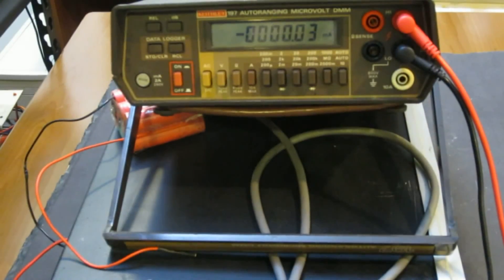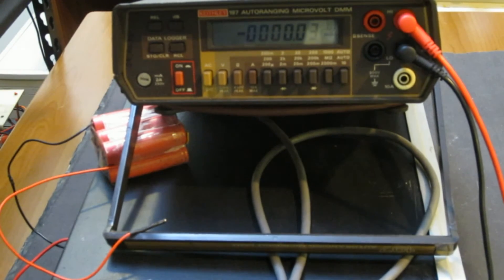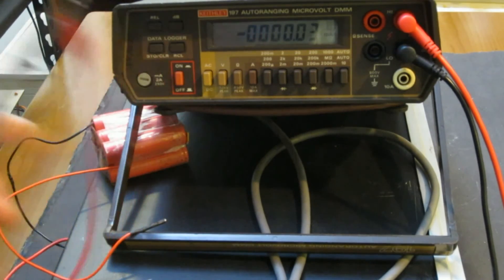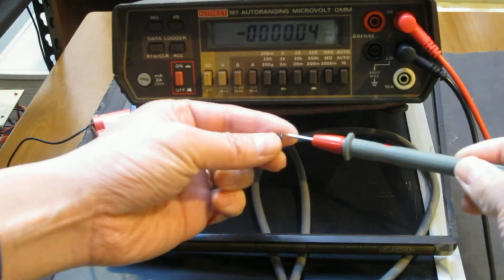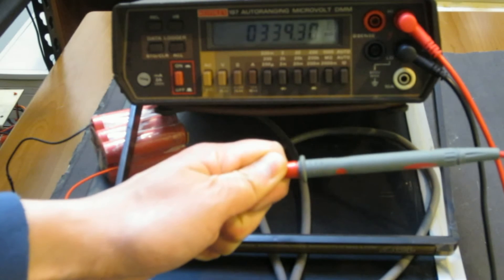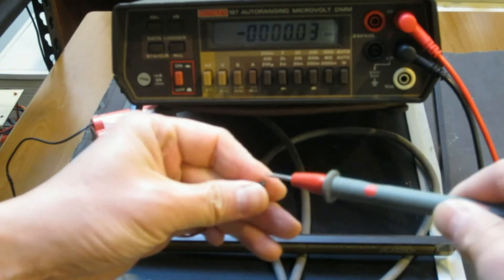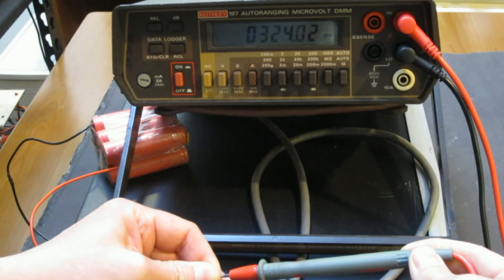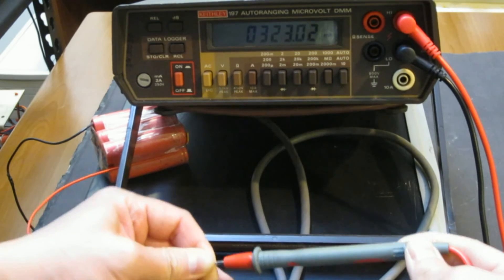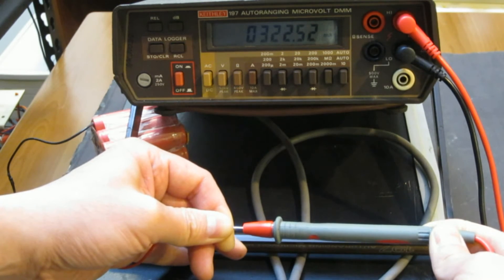So let's now take a look at the consumption. I have the battery here connected to the terminal directly via this lead, and I will take a look at the current. As you can see, it's actually far lower than 500 milliamps. So that's the current draw. If you have a battery pack, this DC voltage standard is going to be able to remain battery powered for quite a few hours.